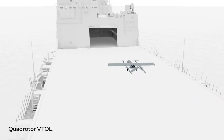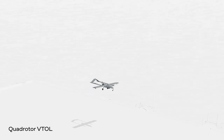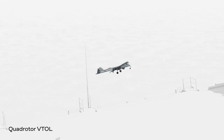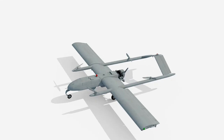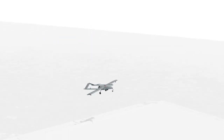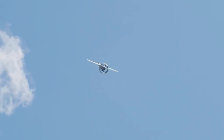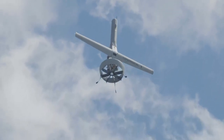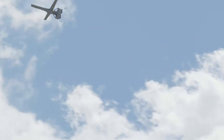A fundamental architectural constraint of hybrid quadcopters makes them extremely vulnerable to crashes during takeoff and landing. Quads maneuver side to side and front to back by rolling and pitching. This method of maneuver works well until wings are introduced. When the hybrid rolls and pitches, the wind gets atop or under the wings and produces huge forces that can overwhelm the propulsion system, destabilize, and crash the plane. By contrast, VBAT's vectored thrust system can apply maximum translation and gust rejection forces in a way that is largely decoupled from its wing and body orientation, making the system resilient in challenging wind conditions during takeoff and landing.